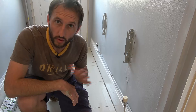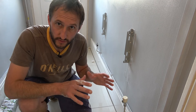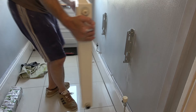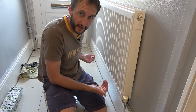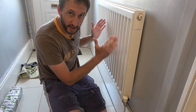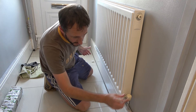A few hours have passed and I've been fortunate enough to get a couple of coats of paint on the wall. It's still a little bit tacky, but it's time to get the radiator back on. We do that by locating the brackets on the radiator into the slots on the wall brackets. Just pick the radiator up and hold it into place. Make sure by pulling on the bottom that the radiator has located into all the little slots — sometimes you'll catch the top two and not the bottom two. So make sure all four slots are located. Then check that the valves line up — I can see my radiator is too far to the right, so I'm gently nudging it over to the left until it's central between the valves.